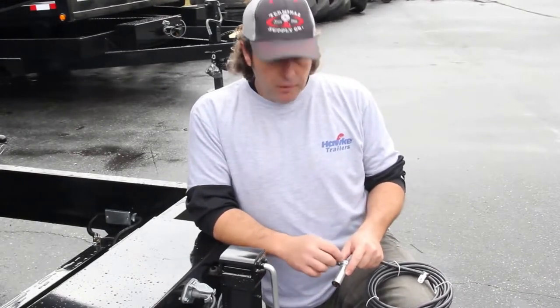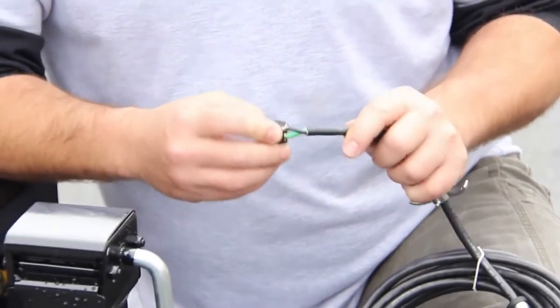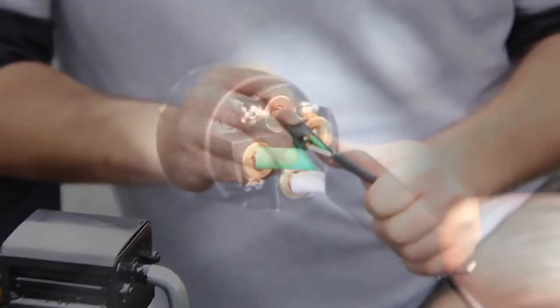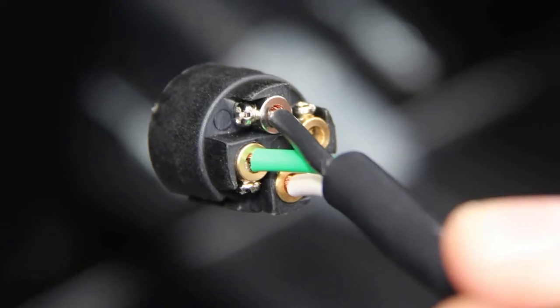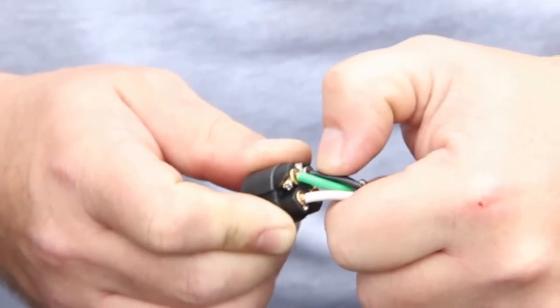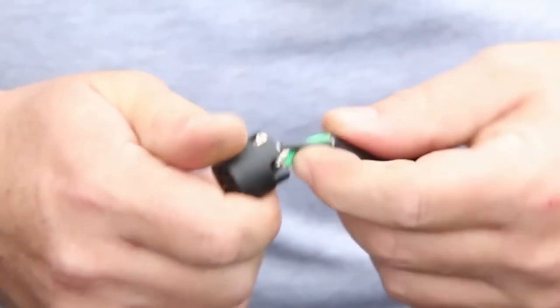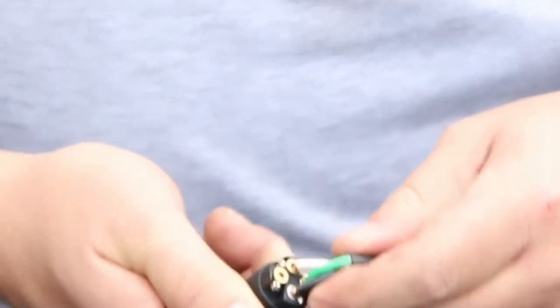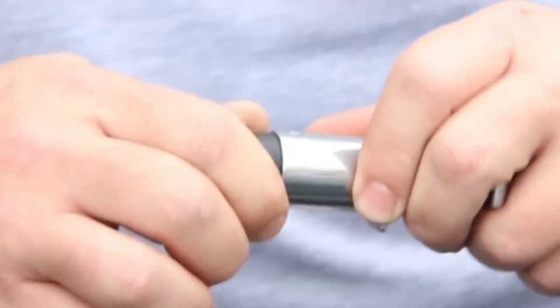To open the plug, release the set screw, then take a Phillips head screwdriver and back out the strain relief. In the back side of the plug, there are set screws for each wire terminal. The current remotes are wired with three wires: black, green, and white. There is a silver post and the other three posts are gold. Starting at the silver post and going counter-clockwise, wire in alphabetical order — black, green, white. This is the correct way to wire a Hawk remote. Once you've got good connections with all three wires tight and secure, reconnect the outside sleeve of your four-way plug.